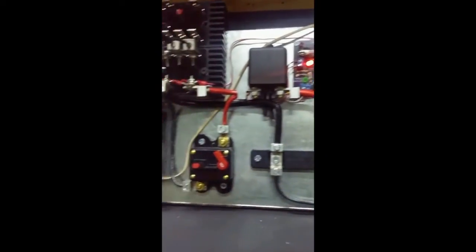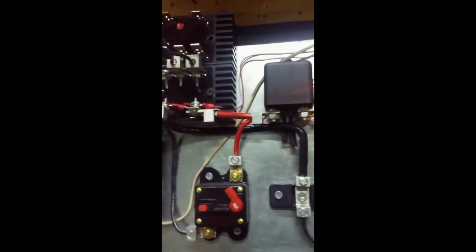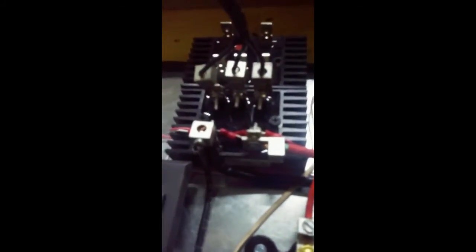If you notice, there's stuff missing for a wind turbine — bus bars missing, some other meters and stuff. The reason for that is this is strictly a dump load system or a DC switching system. If you want to switch to a grid-tied inverter with this, you can too, off your battery bank. Now, this rectifier up here gets tied to your main rectifier — you already have a rectifier in your system. What you do is you just jump from your three-phase rectifier over to this one — lead one, lead two, lead three. And this system is in parallel with your main system.